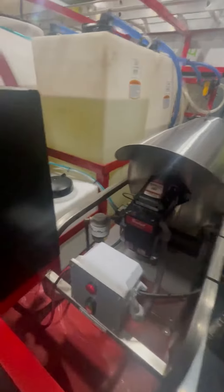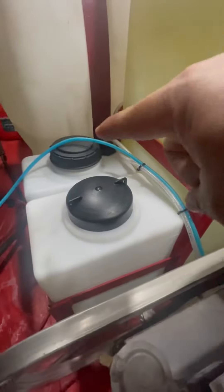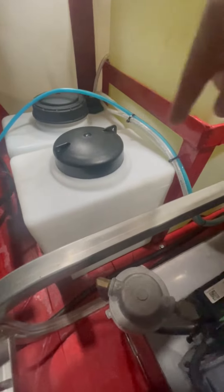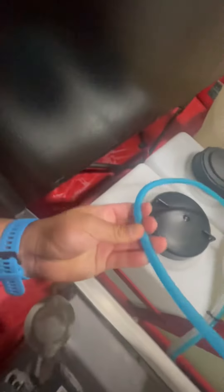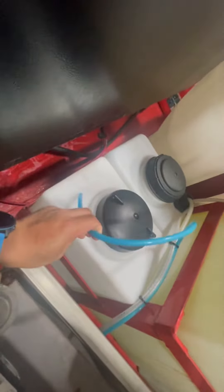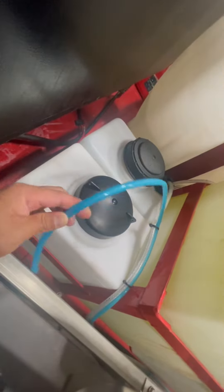Let's go to the back. Now, this video is not updated — what I recently added was a 143 three-way valve. So the top is my soap, the bottom is my degreaser. Whenever I need a bleach neutralizer, I'll swap that three-way valve for the bleach neutralizer, or if I'm doing flat work, I'll go to the seven-gallon degreaser tank.